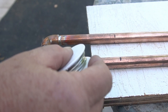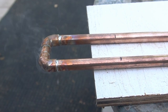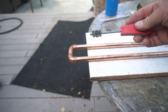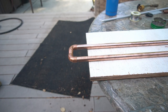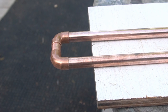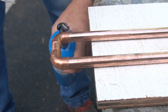This is not for doing your water lines, so it doesn't matter if it's not perfect as long as it holds. You don't want water to get inside, probably — but that went well. I did use flux and I cleaned all the fittings, the 90s, with this little brush. You can get these at any hardware store — it's just easier than sanding, but you can use sandpaper too. Let's see if we can finish the other side; the first one went pretty good.